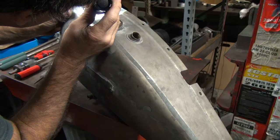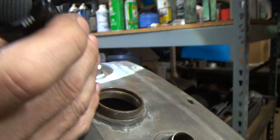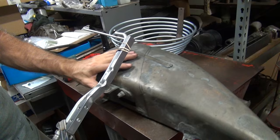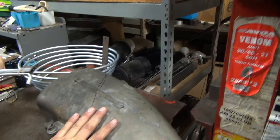Yeah, it's going to blow right onto the front of that gas tank. So we're not painting the bike white because that part might get warm enough to discolor it. It's about 1/4 inch away from the edge of the tank up in here. Because we paint the bike white, the heat from that may discolor the white paint. What about the lead? Well, the lead's going to already turn the paint colors, I'm sure. Nowadays paint isn't lead-based like the paint was in this time frame. No, this is just plain lead, it's not paint. But I'm sure the paint they used in this era was also lead-based and did not react to the base lead there.